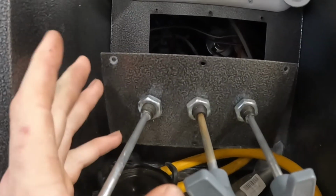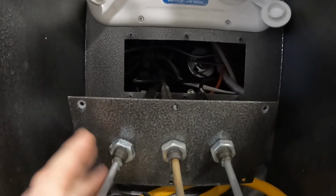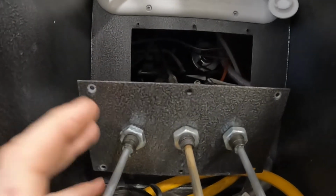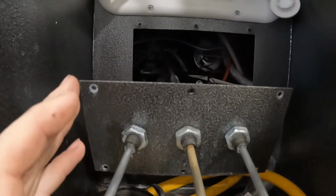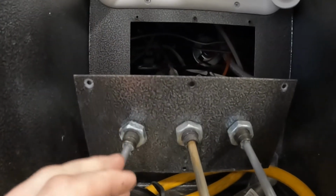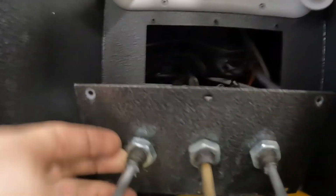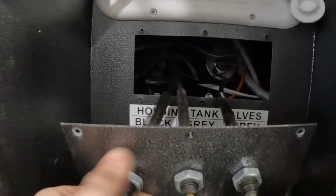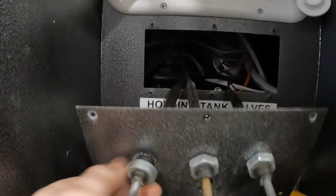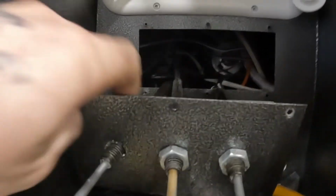Again, this may not be bad, but you're already in it to win it. You're down there at the valve, replace the cable. It comes with the new valve. You could just disconnect the cable from the new valve and swap out just the valve, but again, you're already here, replace it. So the way that I like to do it, now this one's nice because I had a simple little access panel, is you got to remove this nut and get it pulled through here.